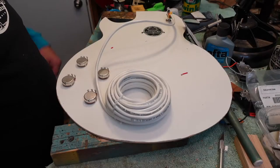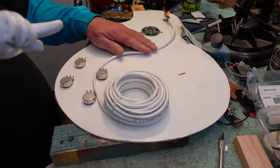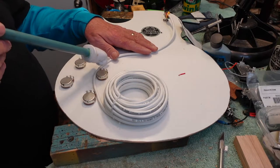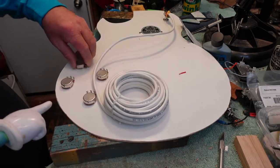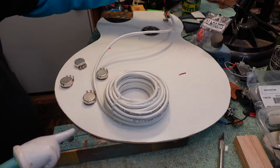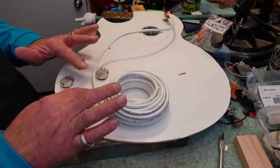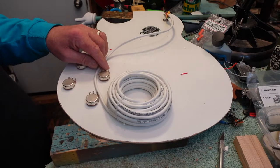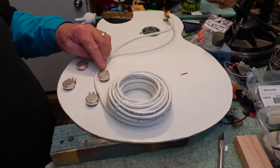installation there. So now we're going to bring our shielded strand of four wires. Look at how nice that lays there. We're going to bring it down to here, and I want to peel it back and give myself enough room here because I'm going to turn these around. We got to jump tone capacitors between these and all this stuff. So I want to give myself plenty of room, but we're going to start peeling this back now and hooking it up to where our input jack would usually go onto the potentiometers, which is a center lug.